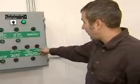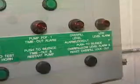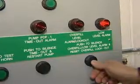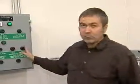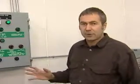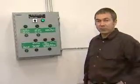We also have a low level alarm on the day tank panel. This would be in the event that you ran out of fuel or something went wrong with your controls and you failed to fill it back up. If the level gets too low, the alarm light will come on and the alarm horn will sound outside. When you come into the plant, you can silence the alarm horn by pushing this button; this light will remain on until you correct the low fuel level. The switchgear is also tied into this low fuel level and has a two-hour timer. If you get a low fuel level, it will allow the power plant to run for up to two hours — typically two hours — and then it will shut the power plant down, with a light on the switchgear controls indicating low fuel level. You'd have to reprime the system, get it back up and running, reset that alarm, start the generators, and resume a normal fill cycle. This protection is in place to prevent running out of fuel, running the engines dry, and losing prime.